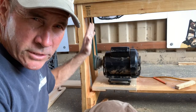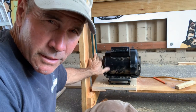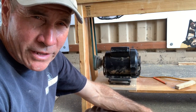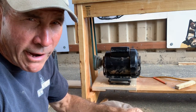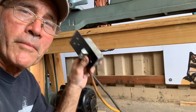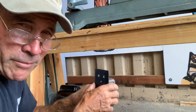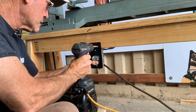I spent some time making sure that the pulley right here was lined up with the pulley up above in the headstock. If it's off-center it would probably stay on, but it's gonna wear out and vibrate. So I spent a lot of time making sure that was lined up nice and straight. I'm gonna mount my switch right there — should probably do a plate out of wood or something, but I'm getting excited and I just want to get this thing going.